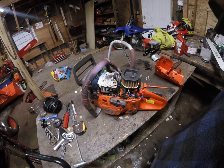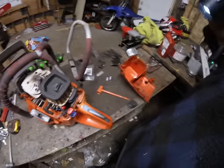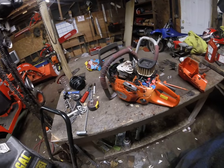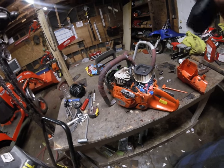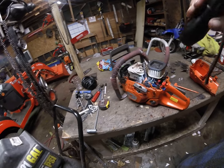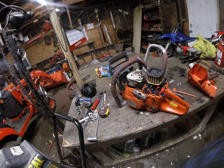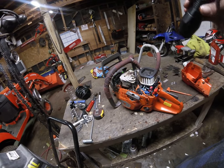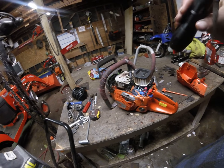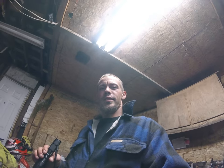Can't wait till they come out with a big bore kit for it, because it'll get one immediately and really wake her up. But other than that, that's the most I've got so far as far as a review for the 576 XP Husqvarna. On a side note, it does get terrible fuel mileage. If you adjust the carb, it gets worse mileage than a 661 Stihl MS or a 395 XP Husqvarna, which is significantly bigger — a 94cc chainsaw. I think that's primarily because of how high the motor revs; it has to work a lot to do the same amount of work as a bigger saw. Anyway, thanks for watching.